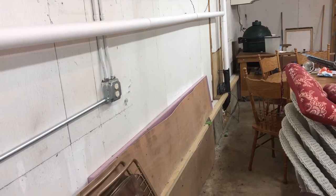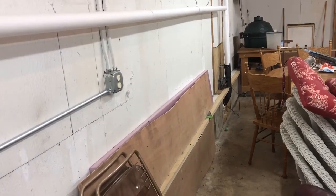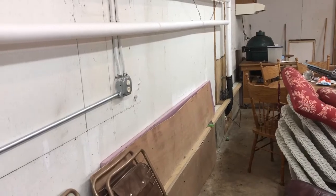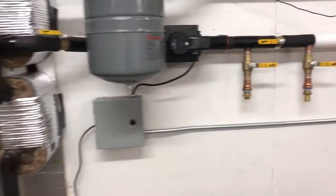Those lines are placed down into a trench — I used the foam-in-trench method to get my lines insulated. The lines go over about 850 feet to the house and enter the garage. Let me talk a little bit about the control of this circuit.